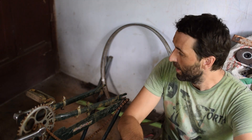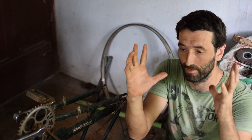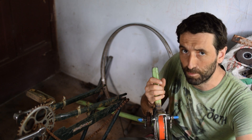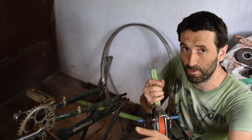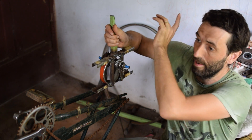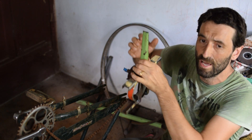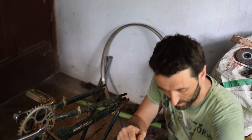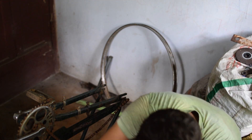With a hammer you've got two forces: one is weight — the bigger and heavier the hammer arm, the more metal you can displace. And then there's speed — the faster you can go, the more hits you get and the more metal you can displace. So with a small lightweight build like this I'm going for speed. I can add springs to add more weight, but the hammer arm is already quite a lot of weight. I'm going to have a small hammer, maybe about 5 kg at most. I'm aiming for speed, which is why I have a very small cam.